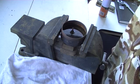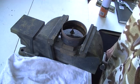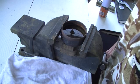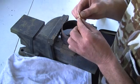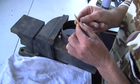So the Berger is annealed. The most important thing now is to make sure that it cools down naturally, so don't tip it into the water. Either pull it out with a welding glove and place it on a soft rag, or just let it cool down for a while. This one's actually cooled down enough for me to handle it now.